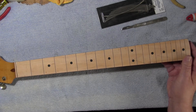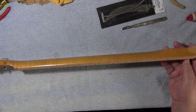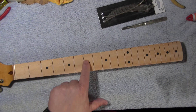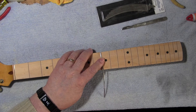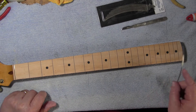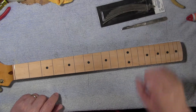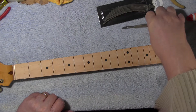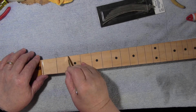Mr. Leo's beautifully sculpted Stratocaster neck — I have to make sure it's the correct radius, then fettle up the fret slots, fit the frets, and get two frets out of each length. I've got twelve lengths from Tone Tech here in the UK; they're online and working despite the lockdown. They've always been very good to me. So now I've got this, I just need to clean out all these slots and measure the depth — I may have to deepen them a tiny bit.